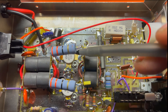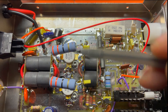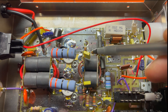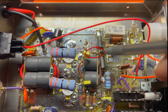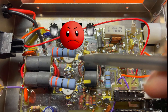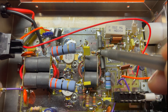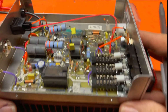A tip for you guys repairing these: say you found a burned-out transistor, replaced it, and the new one burned out again right away as soon as you keyed up. That's because a lot of times this resistor looks great but it's burned up on the inside — so you're no longer dropping down to 0.6 volts; you're hitting the transistor with seven or eight volts, tearing it up immediately. If you're replacing transistors in a Texas Star, make sure to check that little resistor right there. You will be happy if you did.